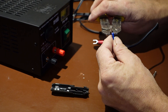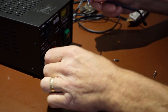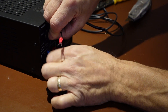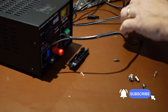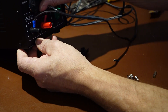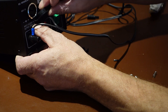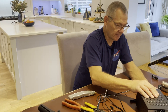That's nice and tight as well — that's not going anywhere. So now we attach that there and screw that on. They're not going anywhere. That's a much better connection, and this is also a DC 13.8 volt output, the same as the cigarette lighter output — also DC 13.8 — so it's going to be the same power supply going up to the rig.